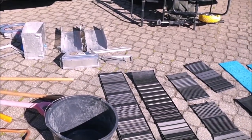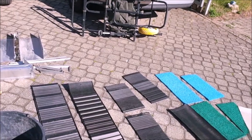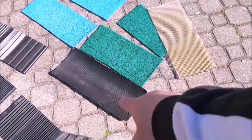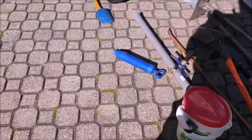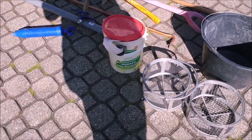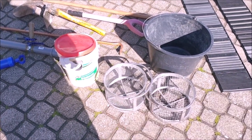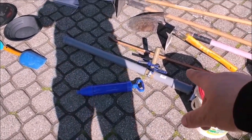I like the GoldHog matting, however I've had to make some dramatic modifications to it in some cases. This little stuff here you can buy in rolls and cut it to shape and size. Most of the other stuff you can get at hardware stores. These classifiers I made - that's a 19 millimeter, a five millimeter, and I'm going to take it down to a 1.5 or two millimeter. The pump I made but you can buy those. It depends on your cash flow.